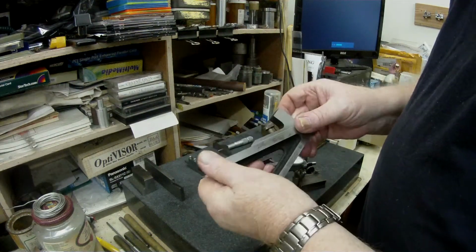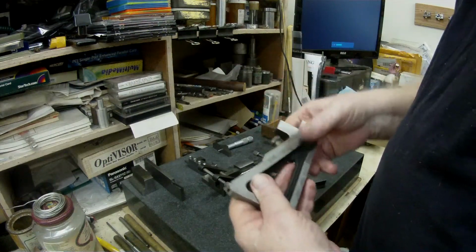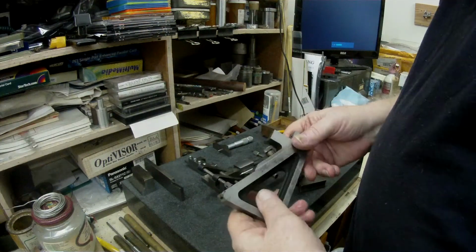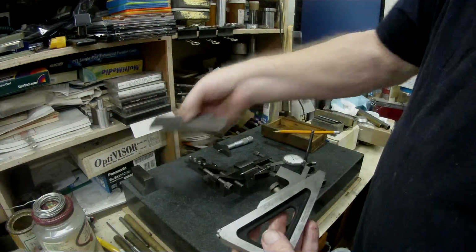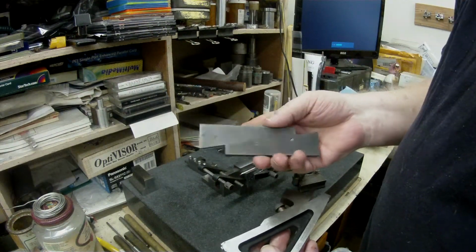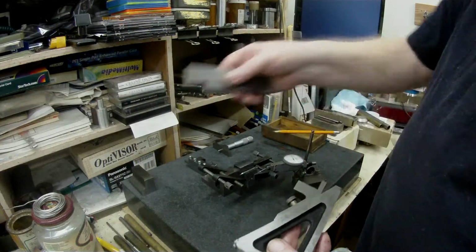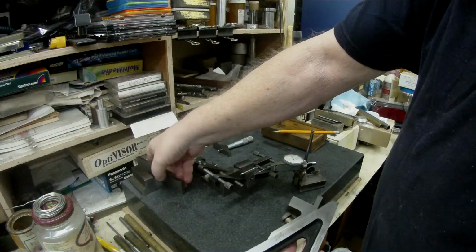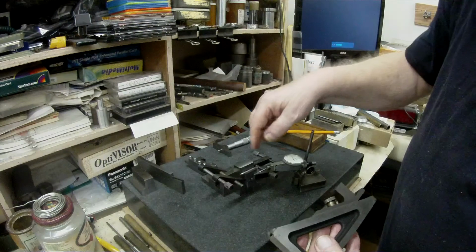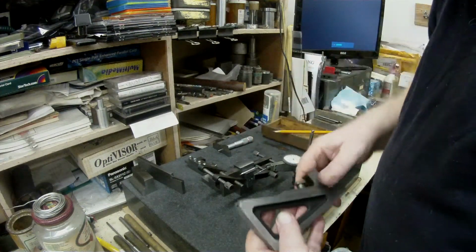Nice tool, very handy. And so most of the time when I'm doing something like this, I'll incorporate this in with the measuring system. And I've got several of these adjustable parallels, and so between this and adjustable parallels or blocks, I can then measure within 1 or 2 thou. In this case it doesn't matter too much if it's not completely flush with this face.